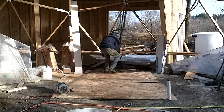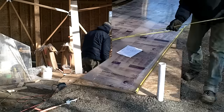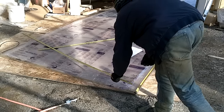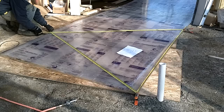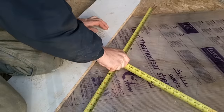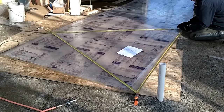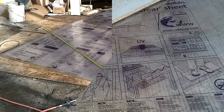The polycarbonate sheets are six by 24 feet long. I set up a couple of sacrificial sheets of OSB on the ground as a cutting area. I decided to repurpose an old tape measure and cut it up so I could easily measure out the various leg lengths for the triangles. With a couple of clamps to hold the ends, it made it easy to triangulate all the points. I found it was easier to make my marks by just poking a nail through the material, since trying to mark the frozen poly with a frozen sharpie was a futile effort.